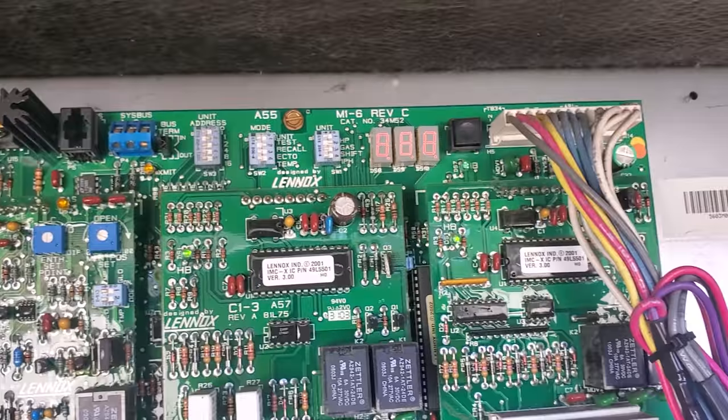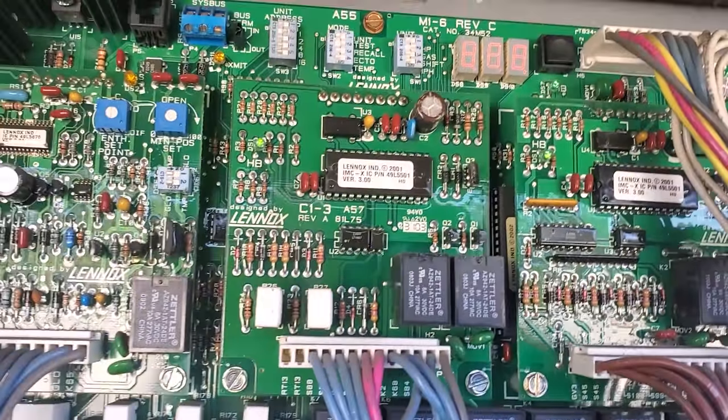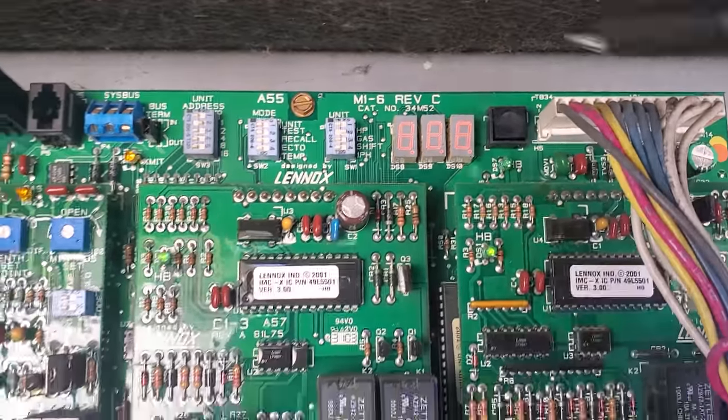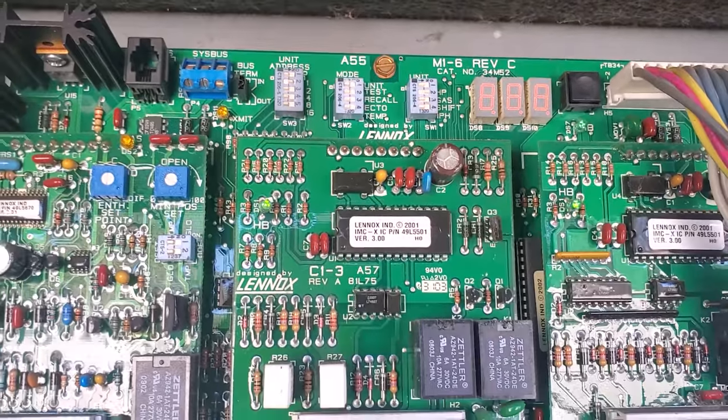Something's up here. That's not good. Let's push this back and make sure none of the dip switches are messed up. Don't see anything. This is just all eights and all decimals — I've never seen it. And notice there's not a heartbeat indicator on this light right here, and even this one the heartbeat indicator is solid. None of them are flashing.